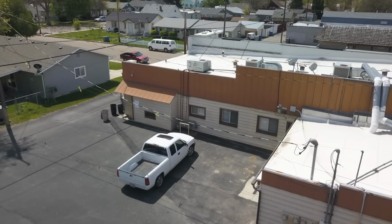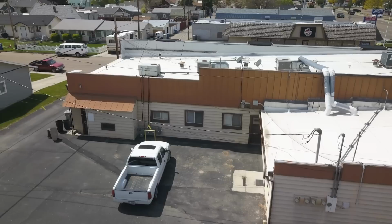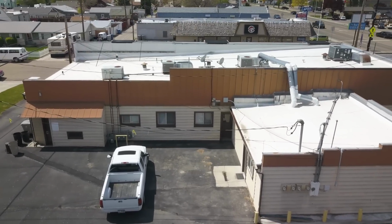The Tower caulking is a water-based product, so it cleans up with water, very simple and easy to use, and it is paintable. I'm always using a paintable caulking. There would be rare situations that I use 100% silicone, but 100% silicone you cannot paint. I was just out working on a commercial building where they caulked all the seams in the metal-sided building, and they used 100% silicone caulking, and you cannot paint over that. It's all going to have to be removed. So I use water-based latex or acrylic type caulking that cleans up with water, and it's got to be paintable, and that's what these two products are.